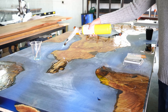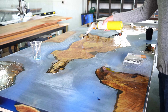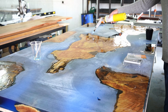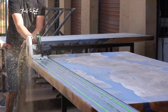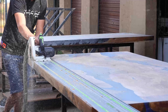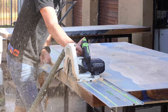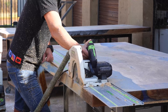This is quite an irritating step and you have to start it in the morning because you're continuously going to come back and fill cracks. If you do it just before you go home, you'll come back the next day and find the crack is still open. It's also critical to use your gas torch on all the small bubbles that occur when you apply this thin layer of epoxy over the wooden section of your table.